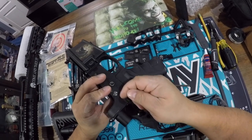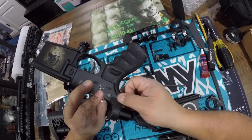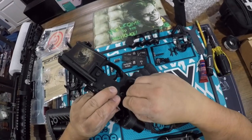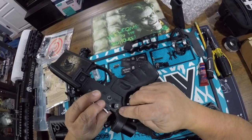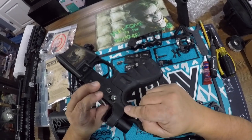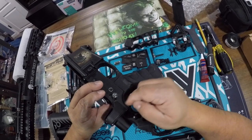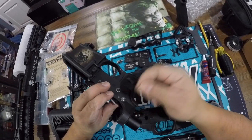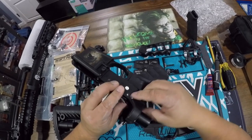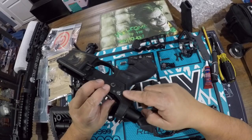Now remind you that spring is a little under pressure, so when you remove that cap, be very careful. You want to slide that pin out, the spring out. Now the pin may just stay stuck in there, maybe a little grease or buildup, whatever it is. But there's nothing tensioning behind it, so you just need to stick a little something in there to push it back, and this will be free to come in and out. And then you can slide in your new pin, and then just assemble everything back.